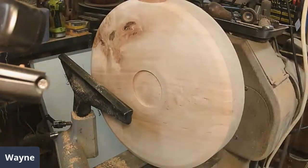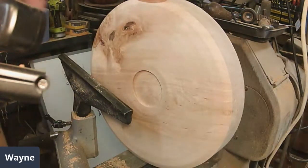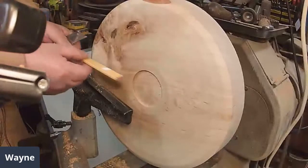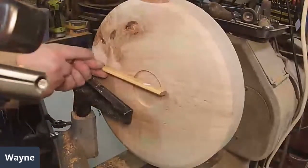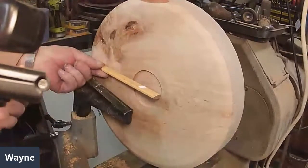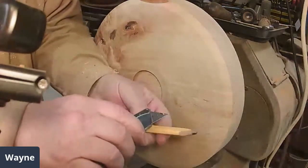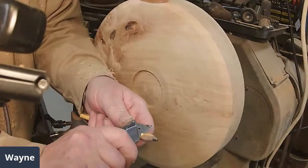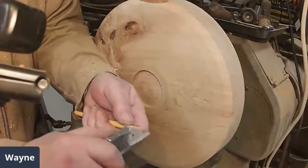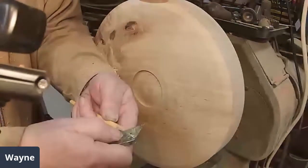Chris Fisher, the blind woodturner, explained this brilliantly with a pencil. Where the grain is running across this way. If you see the point of the pencil here, the grain of this wood is running that way as well. Now, how do you sharpen a pencil? You're going with the grain, but you're actually pushing through the fibres of the grain. So you're pressing down the fibres as you cut, and you get a nice clean cut. You don't sharpen a pencil coming back this way, because you're going to rip those fibres out.